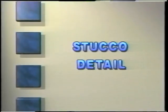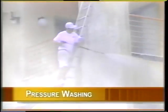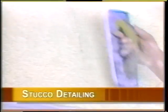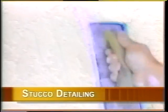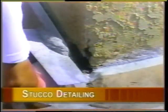The fog coat process: pressure washing, detailing, covering, the application, cleanup, and then final detailing. All stucco and painted surfaces are washed to remove dirt and grime. High impact pressure washing cleans and opens the pores of stucco for better bonding of the fog coat. Stucco is used to fill cracks, dings, holes, chips, and other damage to the existing stucco. It blends into the surrounding area and in most cases becomes undetectable following fog coat application.